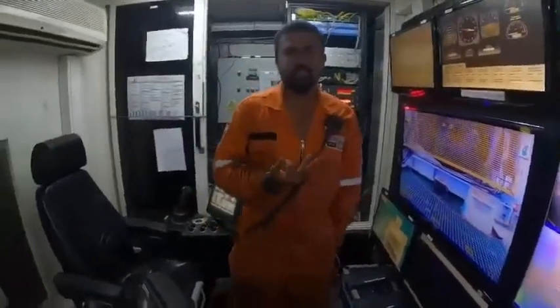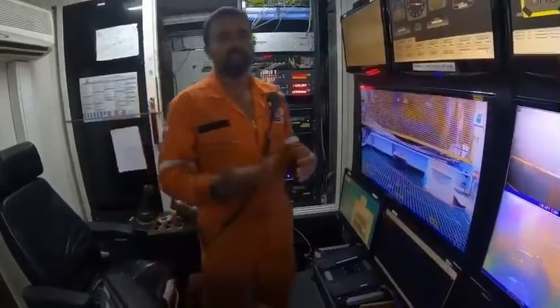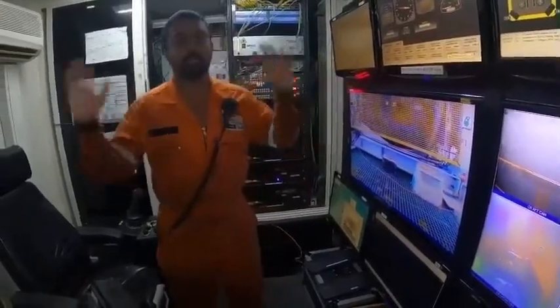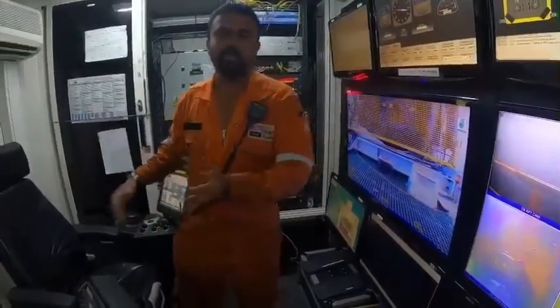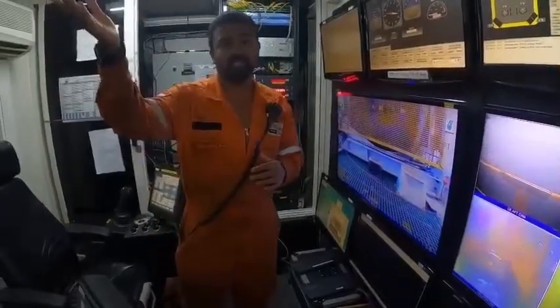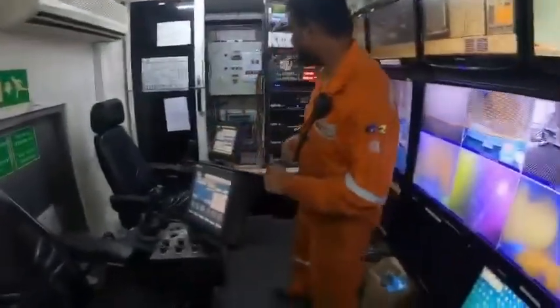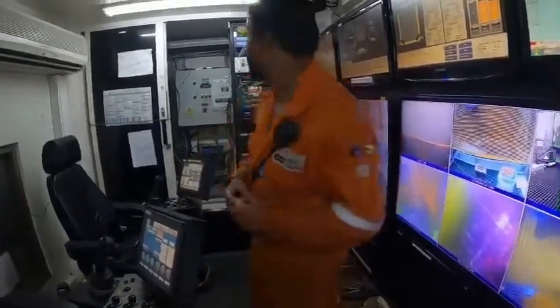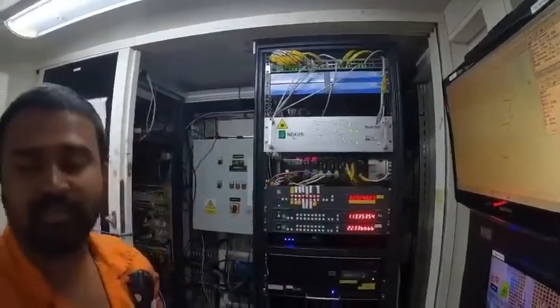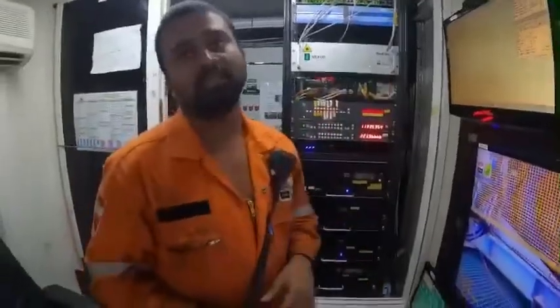Usually on a ship we have a 3-man team. During launching and recovery of the ROV, 2 persons will be on deck — one will be the winchman controlling the winch, and one will be a watchkeeper watching the surroundings and guiding the winchman. The supervisor will be inside the control van to monitor launching and recovering of the ROV. We also communicate with the bridge. We use clear comms, a radio talkie, and a phone — three ways of communication. Since this system uses fiber optic, communication is via fiber optic through a Multiplexer, or Mux, which converts the fiber optic to all video signals and data signals.